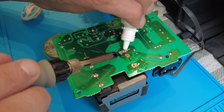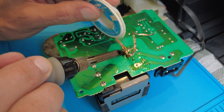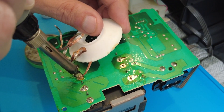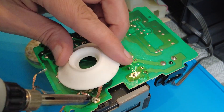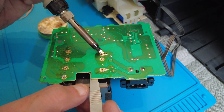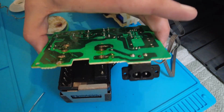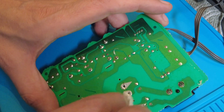Now to remove the old transformer. The solder wick was a bad purchase and useless for removing solder. To overcome this I soaked the wick with a mixture of rosin flux and isopropyl alcohol. Some light leverage and the board is free. I then cleaned up the board with isopropyl alcohol and some wipes.